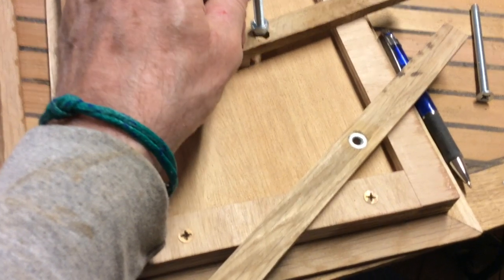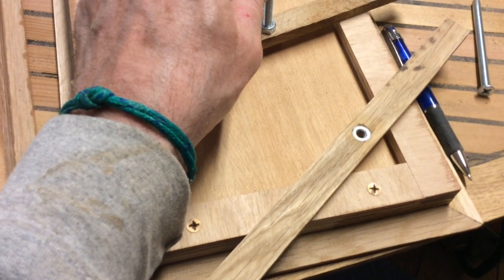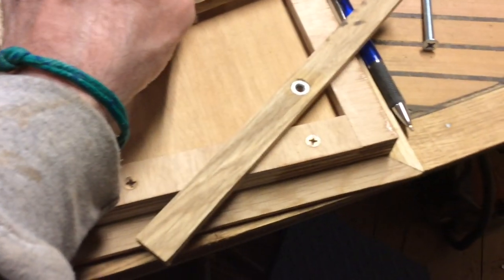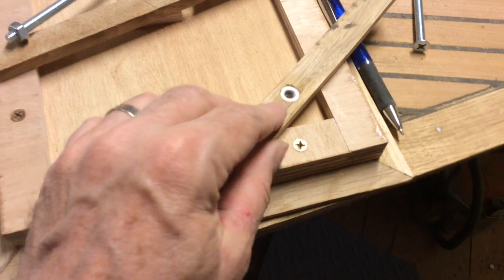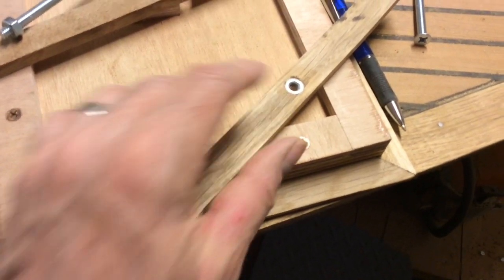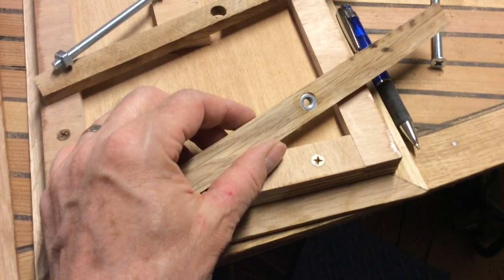Now that's very tight, and I took another one at a half inch and that was way too loose, so I took the nut off of this other bolt. I basically just put it on a nice hard, flat metal surface and took the hammer and started beating it in there. And then I put a little bit of glue in there to hold it.